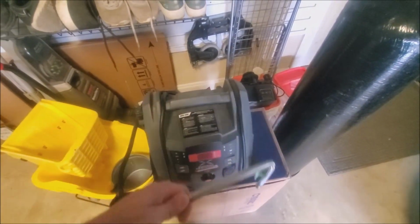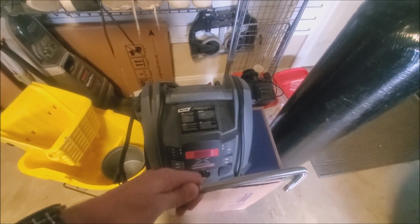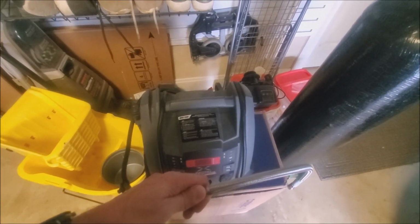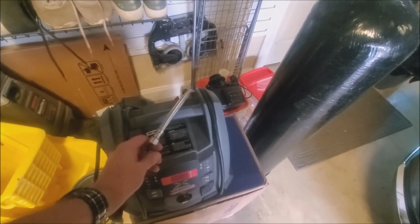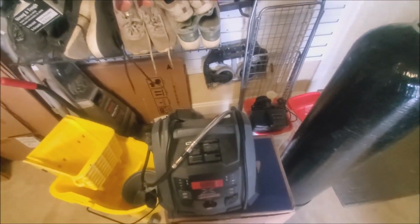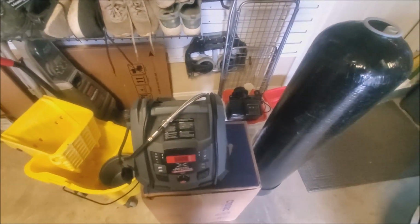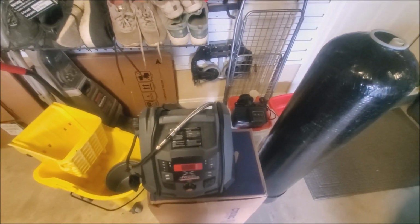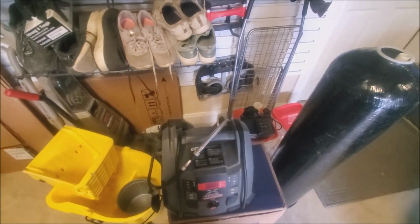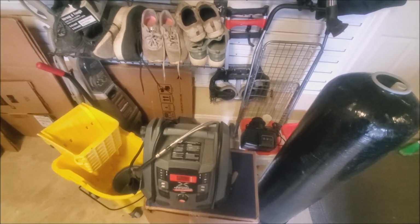I think I went up to like 35 or 40 psi of pressure, and then all of a sudden it started dropping and went down to near zero. And so that's when you know that you've pushed that resin back out through the pipe and at least broken it up. So that's step one. Then get your significant other to work the main water shut-off valve while you're on the phone with her.